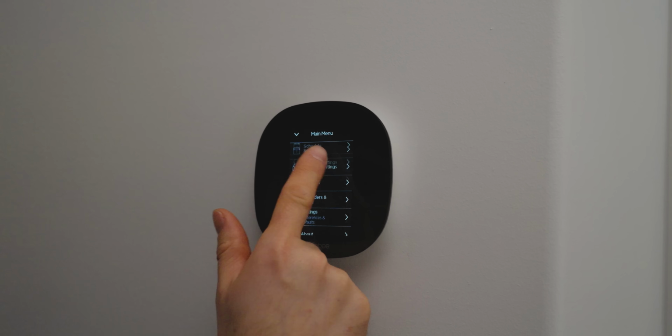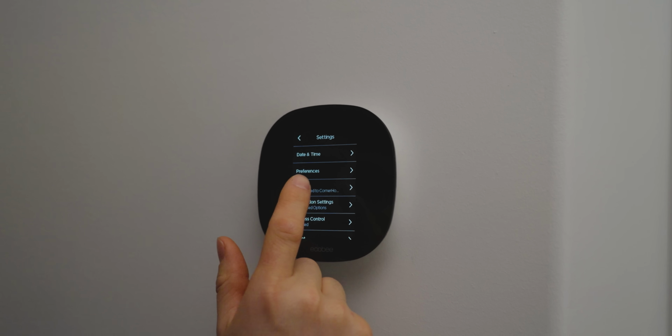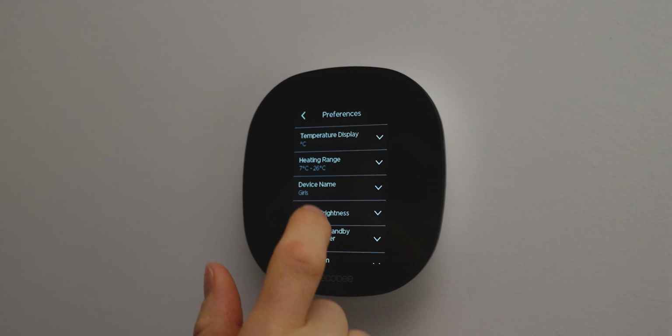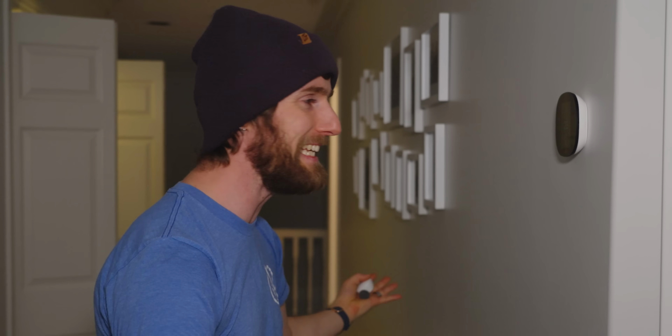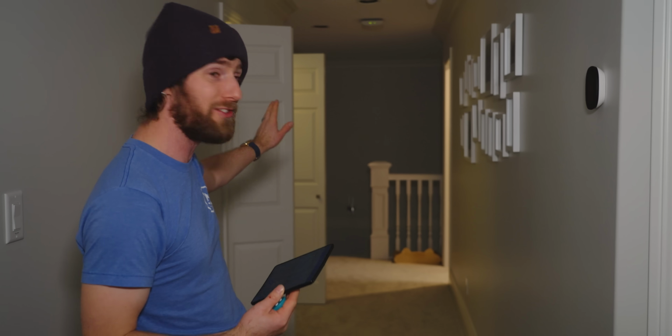That's not inherently a huge problem given that both rooms face the same direction and have similar sized windows, except that the thermostat, and therefore our temperature sensor, is in a completely different space, in the hallway. And my daughters were thoroughly unimpressed to find that the new in-floor heat didn't activate for them at all. Because even though the upstairs hallway doesn't actually have tubes running under it, heat rises, and enough rose from downstairs that their thermostat was always reporting a comfortable temperature.